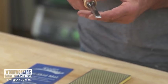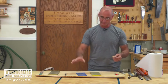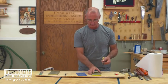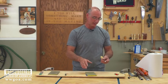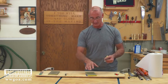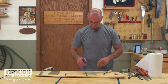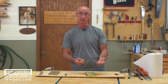We want to keep these cutting to a point where we can pare end grain with this chisel. Let's talk about stone selection. I really like working on diamond stones because, unlike other stones, we can't dish these out. And in a little bit you're going to see me sharpen some carbide — if you're going to sharpen carbide, you've got to have diamond. We need a little bit of lubricant. The lubricant is so the swarf — the filings that come off of whatever it is we're sharpening — doesn't clog up the stone.